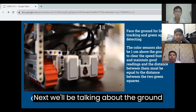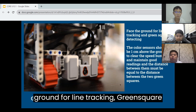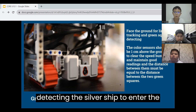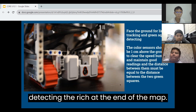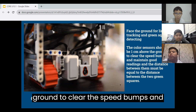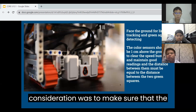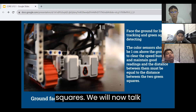Next, we will be talking about the ground-facing color sensors. There are two ground-facing color sensors that face the ground for line tracking, green square detecting, detecting junctions, detecting the silver strip to enter the evacuation zone, detecting the black strip to exit the evacuation zone, and detecting the red strip at the end of the map. When mounting those color sensors, we had to make sure that the sensors were 1cm above the ground to clear the speed bumps and maintain good readings. Another consideration was to make sure that the distance between them was equal to the distance between the two line sensors.